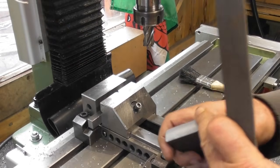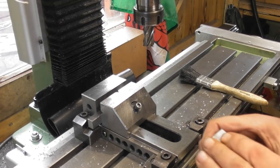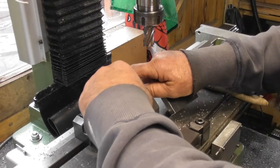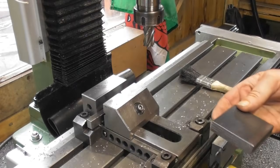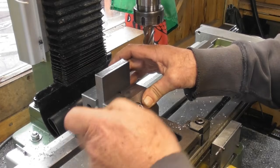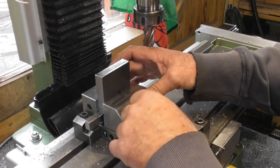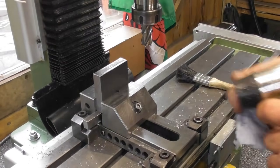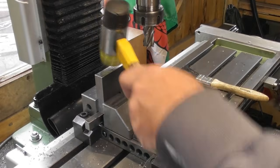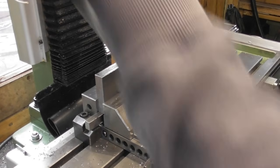Okay, because this space that I've just machined is going to go down onto the parallel. We don't want any high spots. Throw me out a square. So, right, machine to face down. I'm just holding the vise with a little pressure. Oops, that's easy. Just nip the vise. Little tap, tighten up the vise, make sure we're down hard, parallel isn't moving, back across the other way.